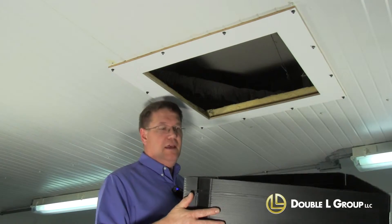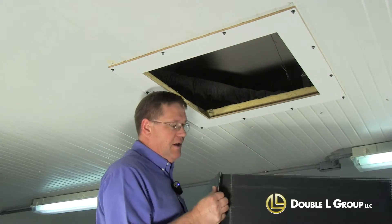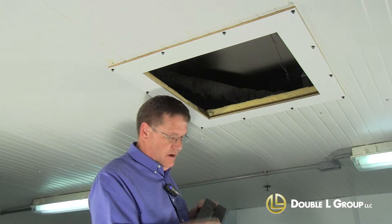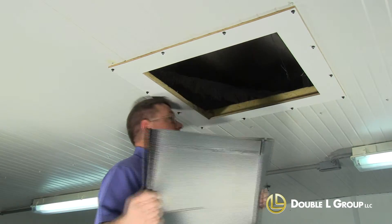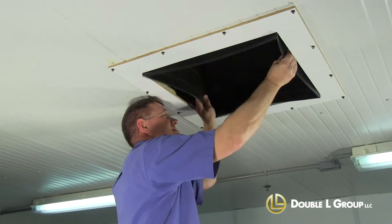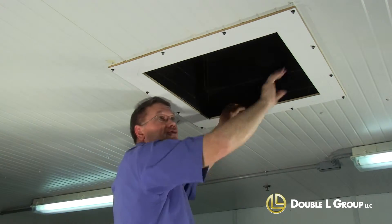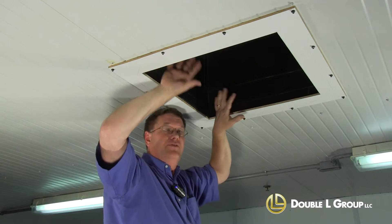This box that the inlet came in is our insulation stop. You're going to have to fold these corners to shrink the box down a little bit. These corners are perforated, so you just bend them in, then go ahead and stick it up into the attic. Just get it up in there, and then we're going to take and screw it into the framing hardware that's already up there to fasten it into place.